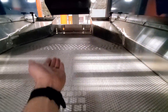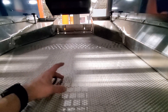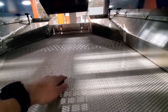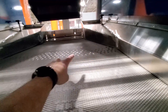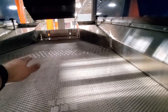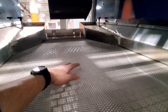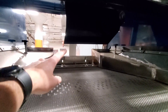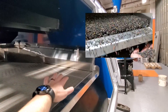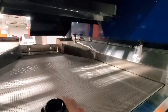The air blowing from below causes the light material — in this case aluminum copper radiators — to float on that bed of air. Those little aluminum flakes float and are not allowed to touch this deck. The copper is heavier, it sinks to the bottom, and those little pieces of copper climb up. Eventually you end up with a line of copper separation, and the aluminum will stay back. If you're doing copper and wire, it will be copper at the front and plastic at the back. That aluminum flake will accumulate and then tumble off the backside, because the table is at a downward angle. It's not the action of the table that makes material go down — it's the accumulation. The action of the table makes the heavies go up.